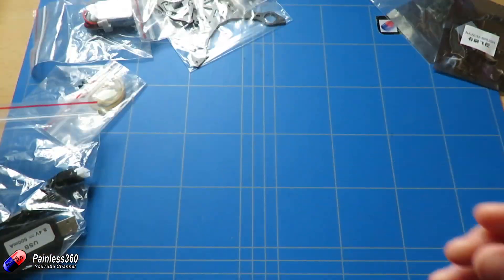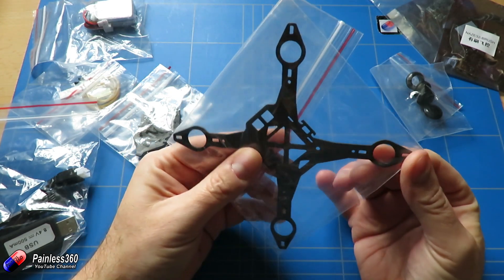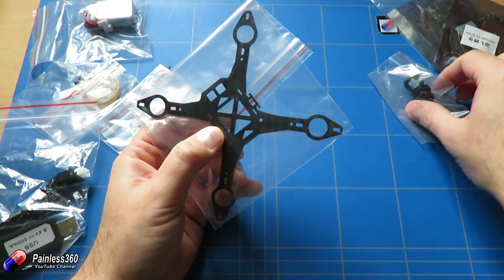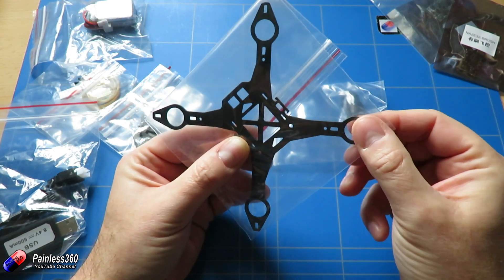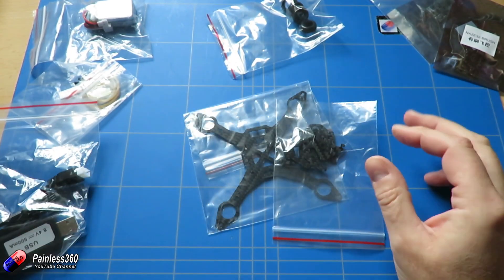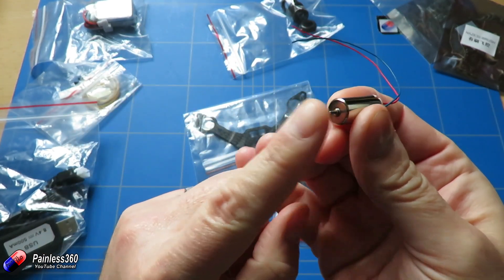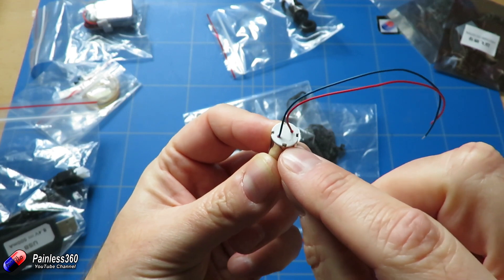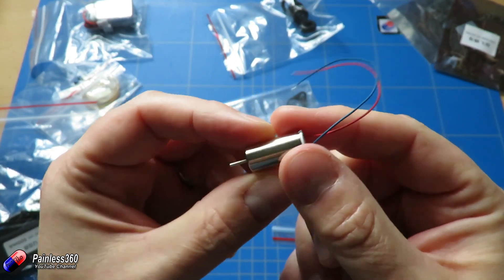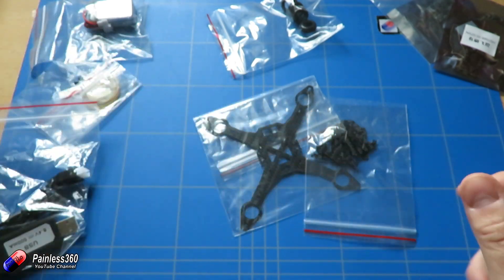Once we know the motors, the next thing is the frame. The frame we're using here is a carbon fibre piece - all one piece with lots of room in the ends. The way it works is that o-rings fit into the ends of the arms and the motors push into them. It has extra supports underneath the motors, which is important because with these smaller motors the bottoms are just crimped on, and if you get too hard a hit on the shaft it can push all the motor internals out the back. The little brushes at the bottom are about the size of a human eyelash, so if they get bent the motor is completely unusable. The supports mean that if we land upside down we're not going to destroy the motors.